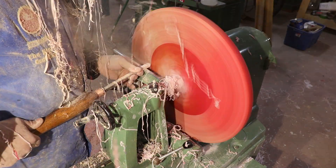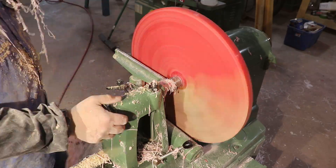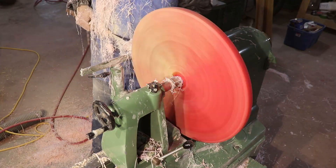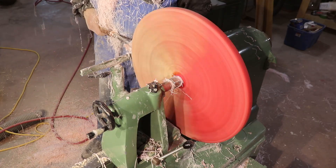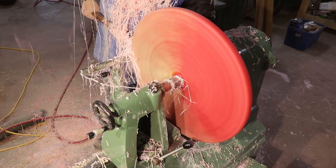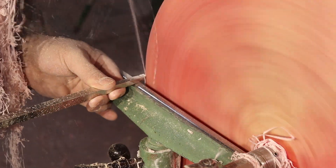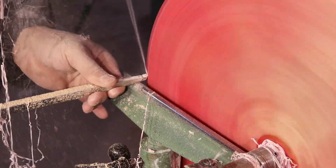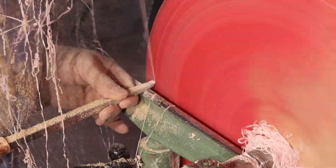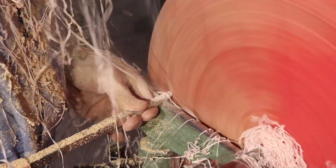I'm going to speed this up a little faster than I normally would. I'm using for the most part Easy Wood Tools — negative rake, the number one hollower, the Pro Series rougher and Pro Series finisher. I also use a skew on the side a little bit to clean up some cuts. The biggest challenge is really setting your tool rest parallel to the face you want for the piece and getting it as straight as you can without any ripples.